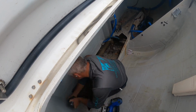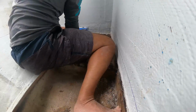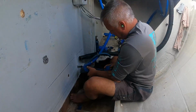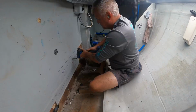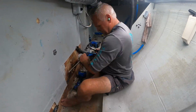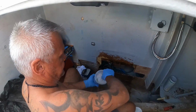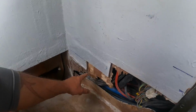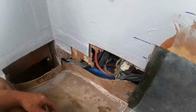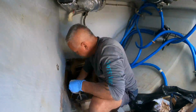In case you've missed our last 2 episodes, we have been working on a Lagoon 400 S2. It had a major bulkhead issue in the anchor locker. You can see it here as Davy's taking it apart, cutting out all the rotten plywood that was left in there. There was water that came down the mast, it pooled underneath the shelf, and it caused rot. The water had no place to go. Davy's been cutting out all of the rot. He's then been fiberglassing it back together on this side. In this week's episode, we're going to show you the double-sided repair from the inside of the boat.